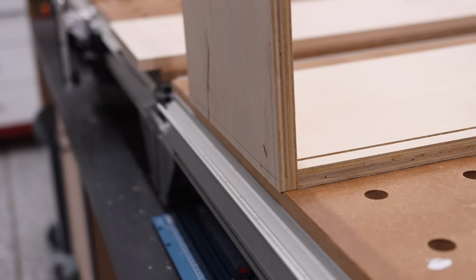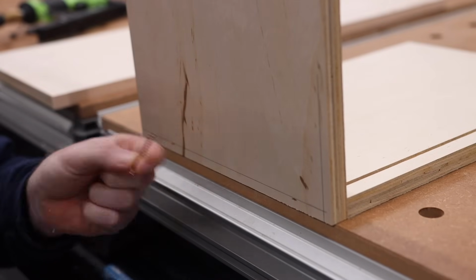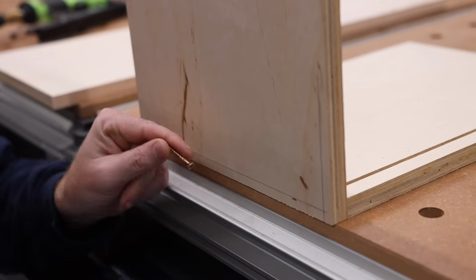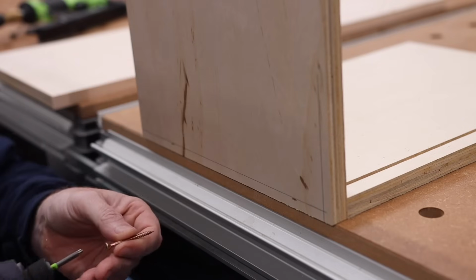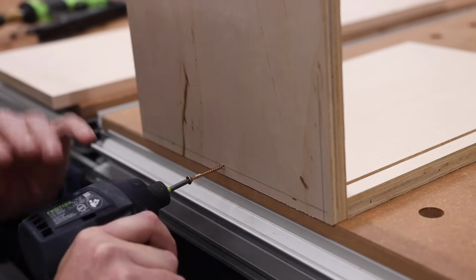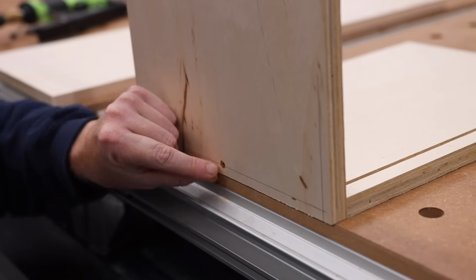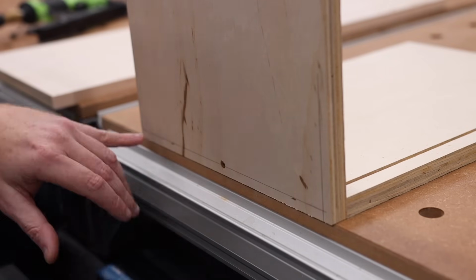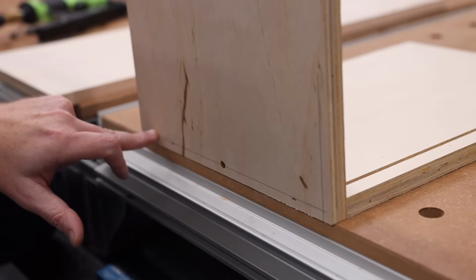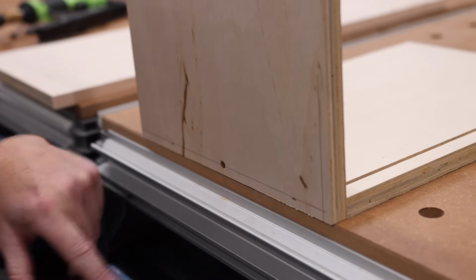It has plenty of holding power, and this is going to allow me the opportunity to go ahead and get some screws in it. A very common question I get is what screws I like to use for cabinets, and I pretty much exclusively use Power Pro screws for a couple of reasons, but the biggest reason is that they self-tap very, very well, and in most cases, it doesn't require any pre-drilling whatsoever. So depending on the material you're using, in a lot of cases, I can just screw that screw in and it doesn't split the wood, and it actually dives into that wood really well and countersinks itself really well and pretty clean overall. Typically on cabinet applications, I usually will pre-drill, but in times where I just don't want to and I want to get stuff thrown together real quick, that's one of the reasons why I really like using those screws.